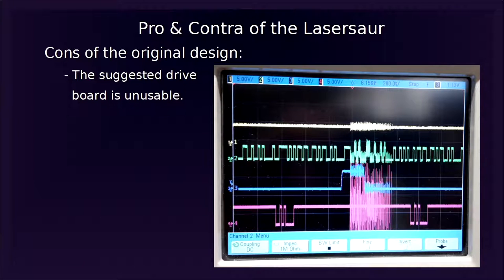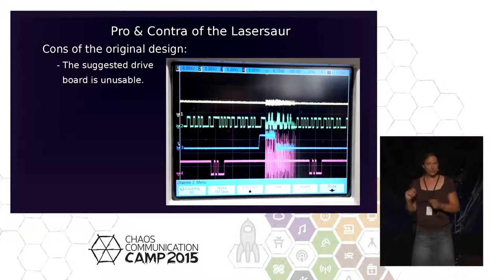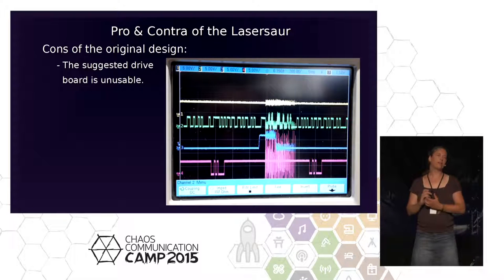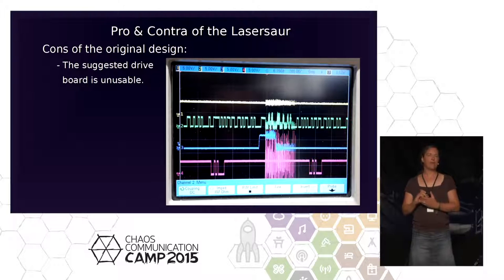I don't want to call it e-waste out of the box, but it comes close. By the way, the stock electronics are open source — fantastic, let's do open source with no clue what we're doing. It's designed in Fritzing. Fritzing is fine if you have a breadboard with three resistors and two LEDs connected to an embedded board. But if you have a larger schematic and are crazy enough to make a PCB out of it — no way. Don't do it. You can't click on a trace like in Eagle or KiCad and see its name; you just see it highlighted between two junctions, with no consistency between the schematic and the PCB.